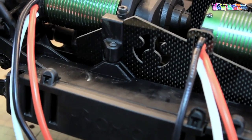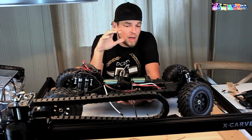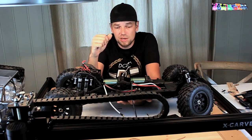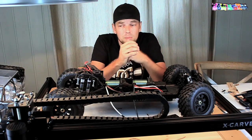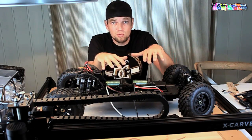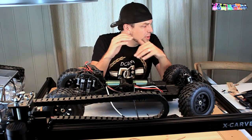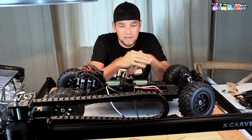There are still a few parts I need to machine, but for now it's most important to show you what kind of quality parts you get when you machine them with the X-Carve, and I'll take you over a few of the steps I took. I'm not experienced with these machines at all and I don't want to damage the machine in the process. You do get a huge waste board — you'll see a clip of that — and I didn't want to damage it either, so I machined all my stuff on a separate under-layer, whether that be a sheet of wood, a pizza box, stuff like that, just to protect the working surface of the X-Carve.